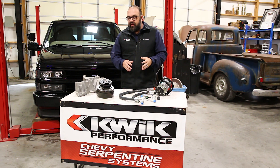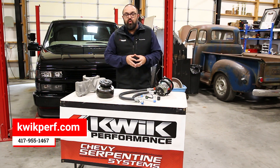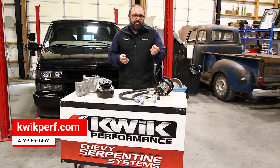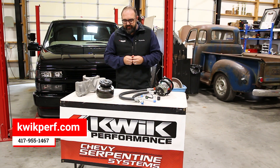There are a couple reasons you may want to upgrade your R4 compressor in an 88 to 95 truck. Some of the earlier ones had R12 refrigerant. Those may or may not have been converted, or it was simply replaced with an orifice, and it's time to actually redo the system to really regain the efficiency of your AC system.